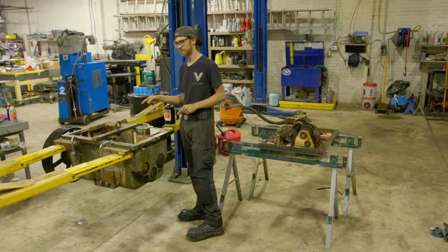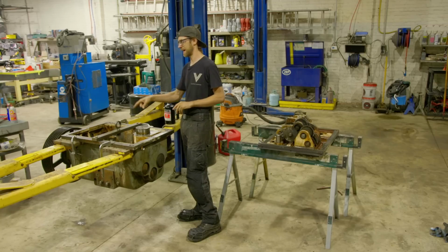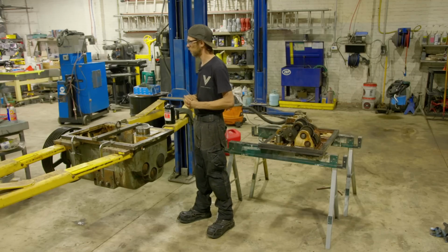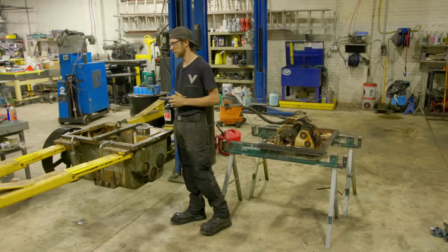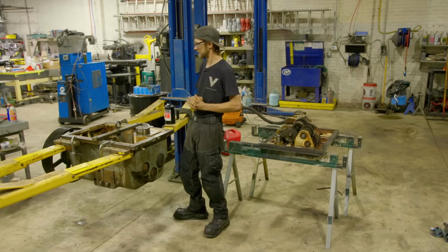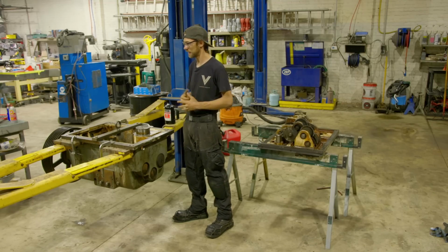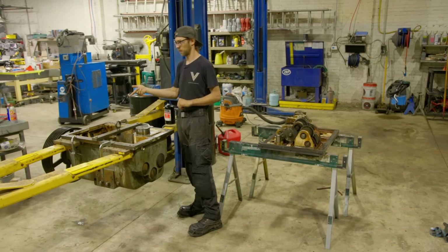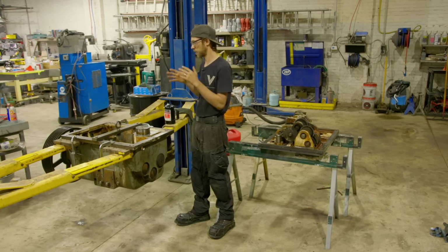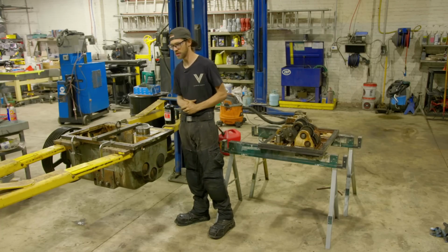And then on this gearbox, we are going to be making 2 modifications. One, the oil drain plug is extremely difficult to get to, and for that reason, I think this wasn't changed. And so what we're going to be doing is adding a 90-degree drop and shooting it out the front so that from the front of the machine, without any disassembly, we can drain the oil quick and easily. And then I am going to be adding an oil sight to this gearbox with a tube coming out the front. The reason for that is it does have a dipstick, but a dipstick just isn't as good as an oil sight. An oil sight allows you to see the level and the condition of the fluid. And if it's out of sight, it's out of mind. And I think with the dipstick and the fact that the oil drain was really difficult to get to, it made changing and monitoring this fluid a little bit more difficult. So we're going to make those adaptations so that we can be much more likely to monitor the quality of the fluid and the level and change it a little bit more easily.